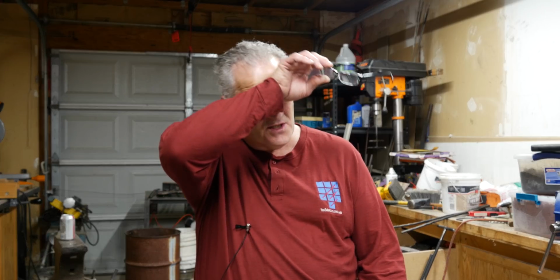I was out here trying to cast something the other day. It was over 100 degrees in here, and I picked up the mold and it just collapsed on me, because the sand was warm. I mean, it was warm to the touch. So I'm not sure that keeping your molds warm applies to oil-based sand. I see a lot of guys with green sand, the water-based, that bake their molds. That is clearly a technique that gets used. I just don't think you can do it with sand with oil.